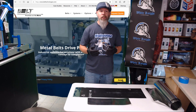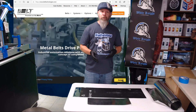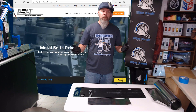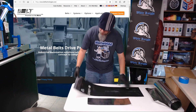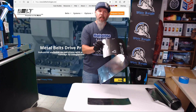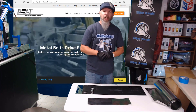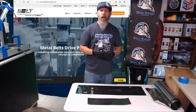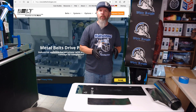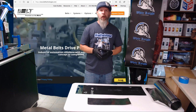Unfortunately the first quotes for a seamless belt still were not practical. So I said, just send me the material. They sent me a flat piece of fully hardened stainless steel, and I put it together with just aluminum duct tape. It held well, it did the job. I put my coating over it, and it made it through the prototype stage and worked great. Unfortunately over time, I discovered I can't tighten the belt down a lot, because it will start to stretch the aluminum tape and the build tack over top of it, and then it gets really hard to keep the belt tracking straight.